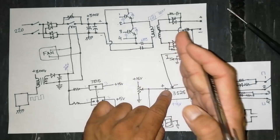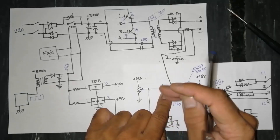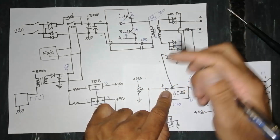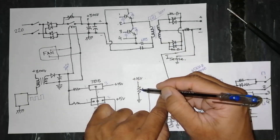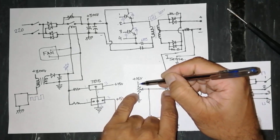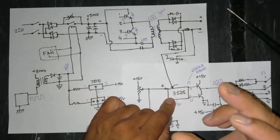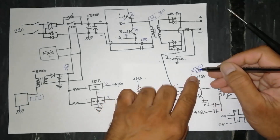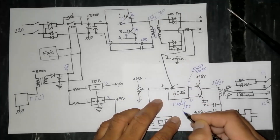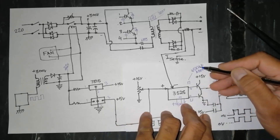For example, we apply one volt to set 100 ampere output. Rotating the potentiometer to mid position means 100 ampere; full clockwise is 200 ampere; full counterclockwise is zero ampere. With one volt applied between the non-inverting input and ground, this IC will start switching and oscillating at a frequency set by the RT/CT timing resistor and capacitor — for example, 45 kHz.